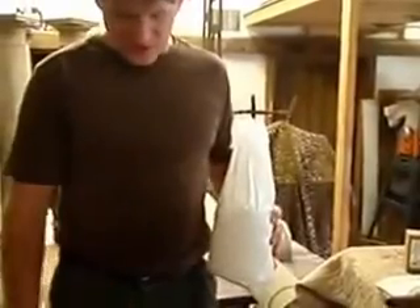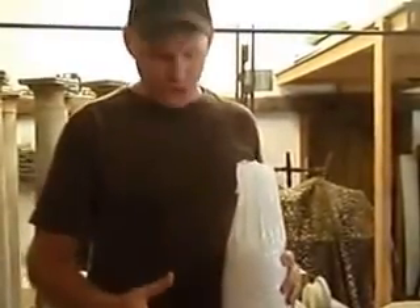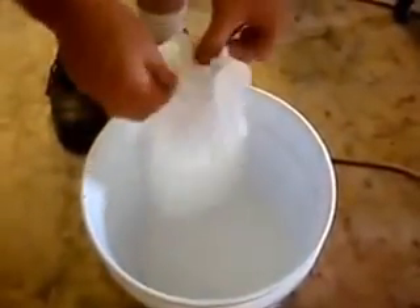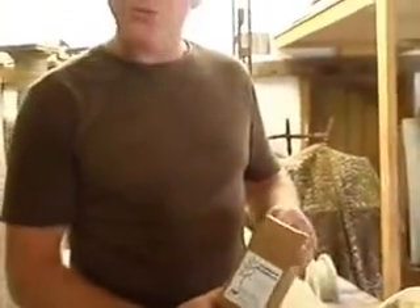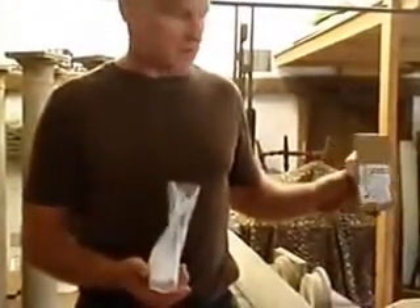We're going to dump all the powder in on top of the water. I like this process best because it doesn't allow the dry powder to get stuck to the bottom of the bucket — you're not constantly trying to stir it up with a dry bottom. We immediately add the outdoor additive, which is a borate-based compound. When mixed with the paint it gives much more longevity and durability, and acts as a natural biocide to keep mold and mildew from attacking the paint. This bag is pre-measured to mix into one gallon of paint, so just open the bag and add it in.